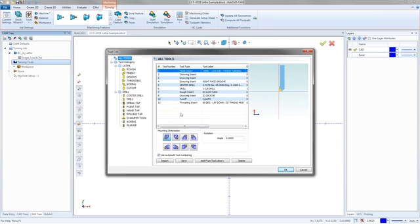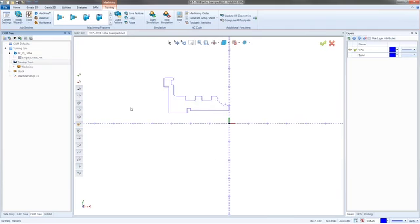So I got 11 tools going through here. Some for roughing, some for finishing, a bunch of different groove ones because some are on angles, all this kind of stuff. So you can see all the tools. Let's see, here's our threading inserts, grooves. So there we go. So now I'll go ahead and hit OK. We have the tool crib set up.